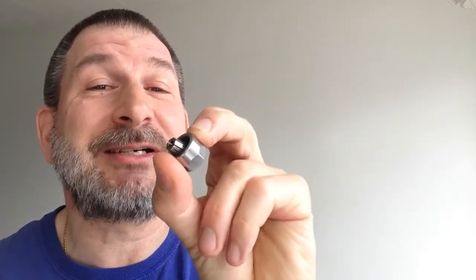So if you haven't snapped your collet in, this might help your vibration issues. For me, as far as I could tell, the threads on the spindle itself were improperly cut — they didn't seem deep enough, they seemed a little bit too fine of a pitch. And when you put the collar nut on it, it didn't tighten down properly, and the bits were just not in there tight.